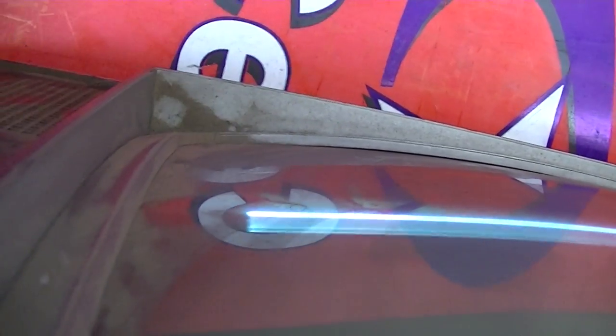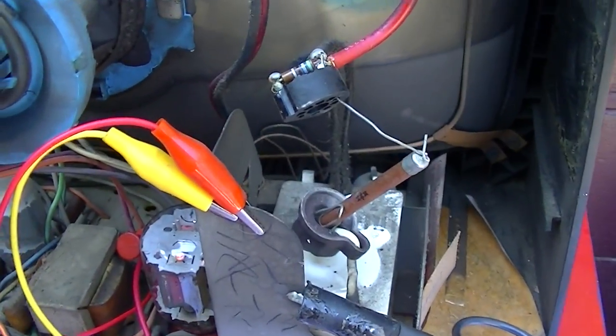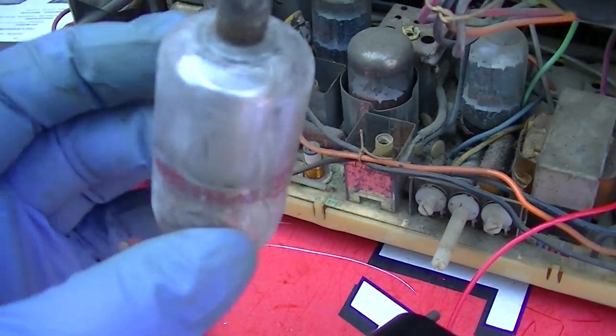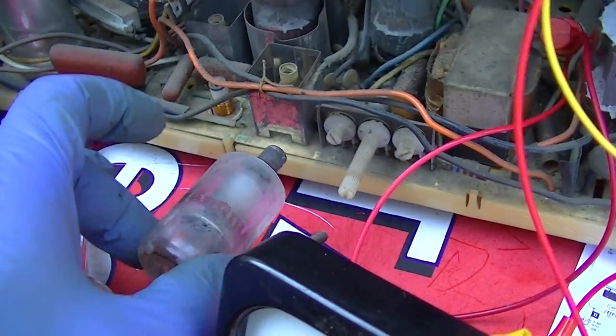Oh yeah, no vertical. And the horizontal deflection, it's not going all the way to the end. So now we have high voltage. Now we just need the vertical. You know, probably, I don't mind ordering one of these tubes. I can't imagine this would be very expensive if you could even find it, but